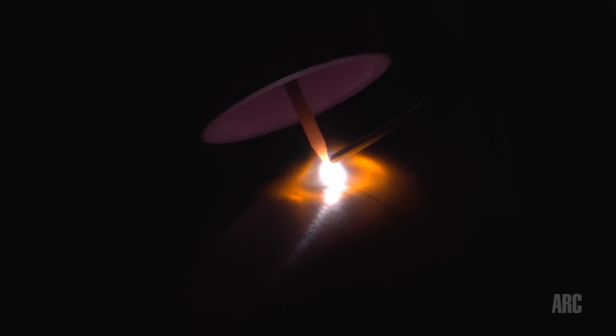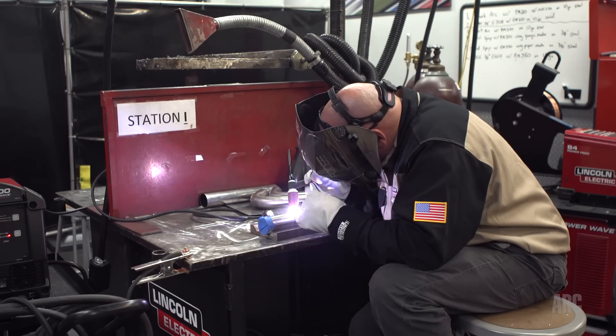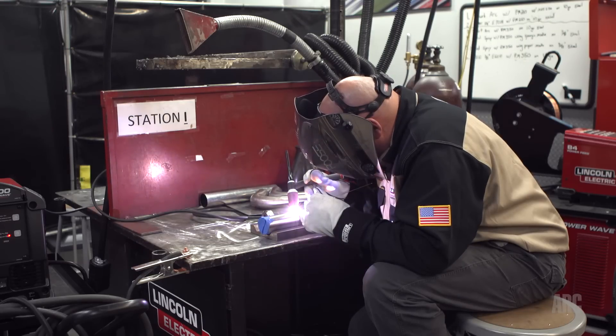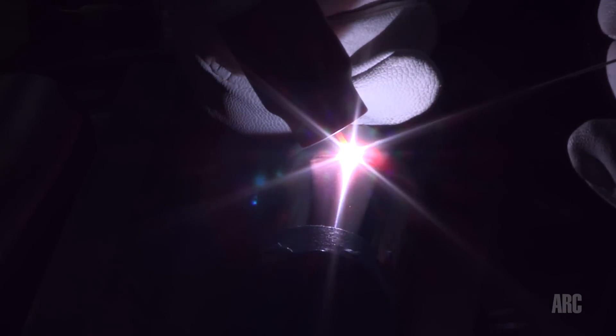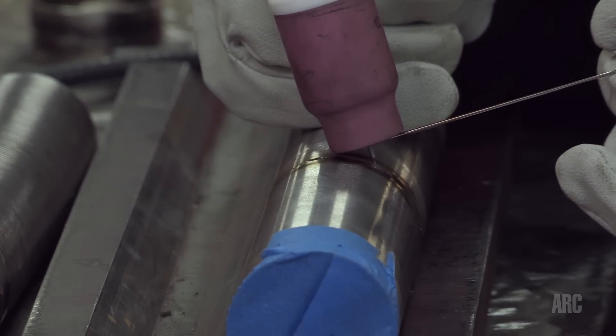Fit-up is very critical — if you have a gap on material this thin you can have a real hard time filling it. I'm trying to keep my torch work angle pretty much straight in, with the filler wire added to the front, and travel speed just enough to let the puddle wet out. You've got to take your time with these nickels. We're not worried about getting penetration to the inside — 28 thousandths material will break down on the inside very easily. What I try not to do is make the weld too flat on the surface; that's why I'm using filler. Coming up near the end of the weld, I want to make sure I fill the crater at the end, so I'll back off the pedal real slow, give it a little extra filler metal, and keep the torch right on the puddle with the gas flowing over the crater until it cools down to protect it.